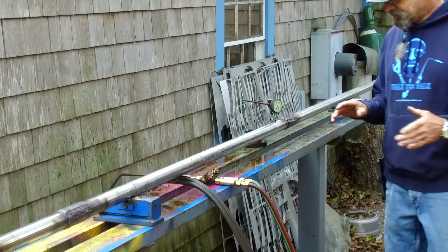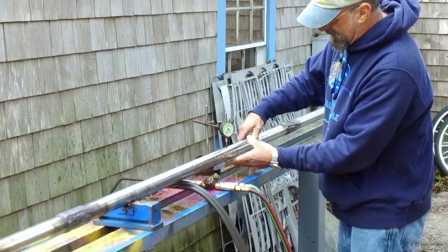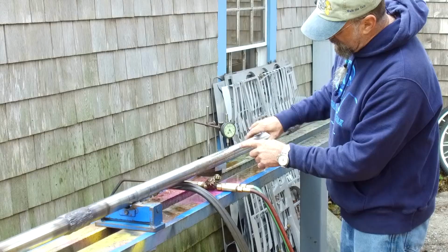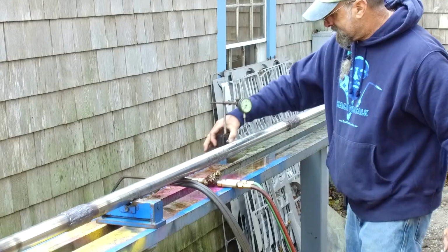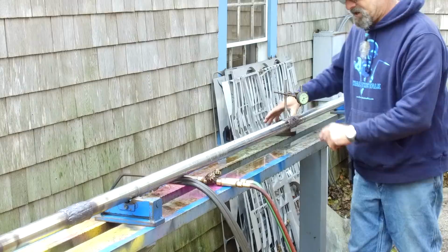Okay, we came back out here and we had about an 8 or 9 in here, but we took our indicator and walked our way on down here. We had about 5, and we came in and found that we actually had about 9 or 10. So we brought our indicator over here and sucked this down to where it's reading about a couple thousandths now. It helped bring this down to that same couple thousandths. And this side here is running nearly perfect.